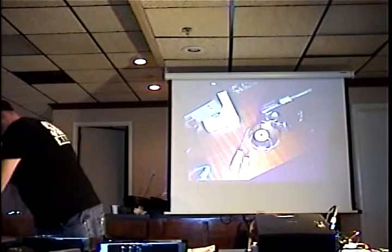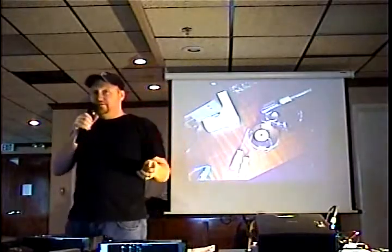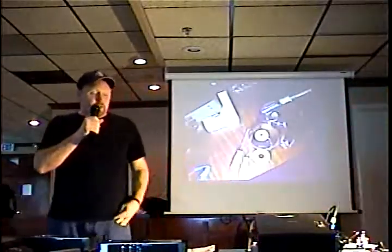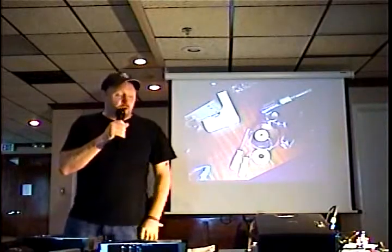Any more tools, what I got? Oh, if you're going to solder, you might want to use some thin solder. The thinner, the better. You don't need big, huge solder because all you're going to do is make a mess. You're going to get too much on the iron or whatever, and you just don't really need that much if you're going to be soldering. So you can get some really fine silver solder. It works out pretty good.